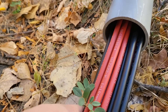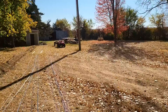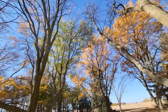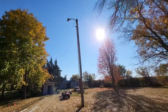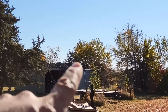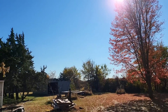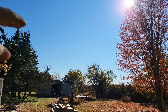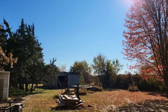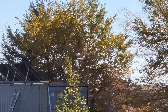Optimally you want your solar array as close to your house as possible, but we have a lot of big trees around the house. The closest spot with decent sunlight was down over there. We have some trees to the south we may eventually trim back, but once leaves fall off in winter you don't get much shading from them. The sun angle in summer is high enough it won't matter. I'll gather data and decide whether it's worth trimming those trees.